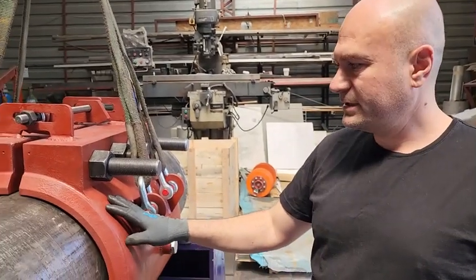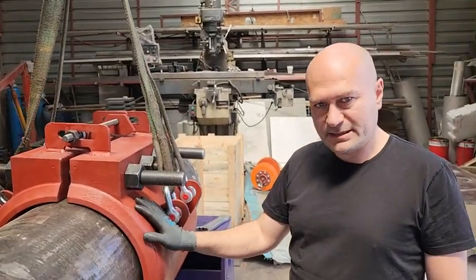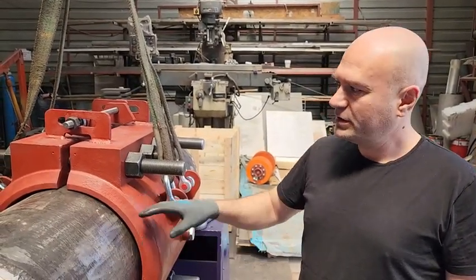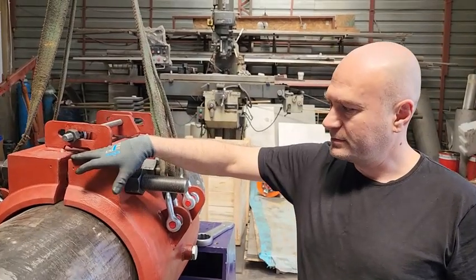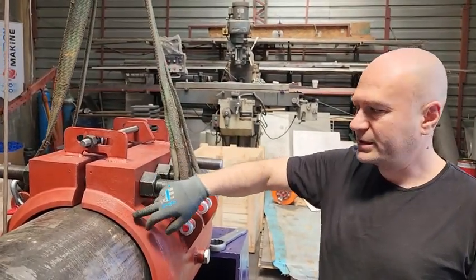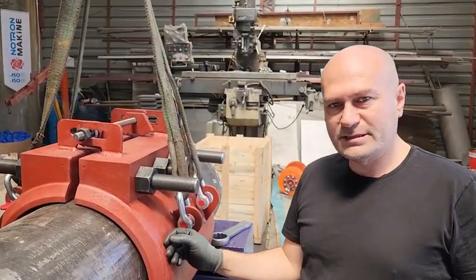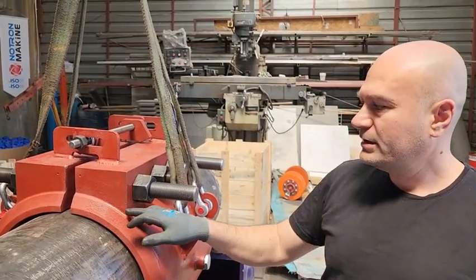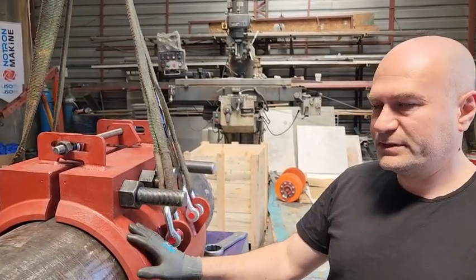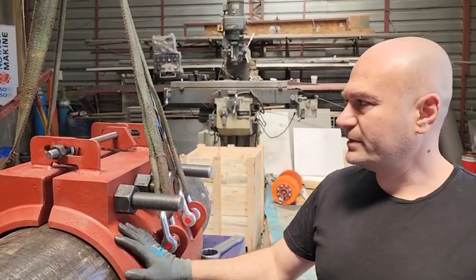The sleeve has a body made of die cast material and is completely monolithic. If it had been made from sheet metal, the shield part would be sheet material and the screwing part would be a billet, requiring layered welding to join the two parts — and an MT test at each layer. Since we do not manufacture these clamps that way, there is no need for MT testing.